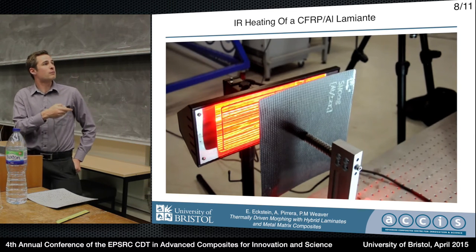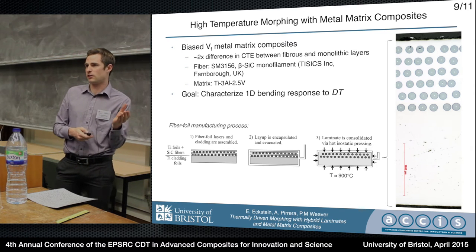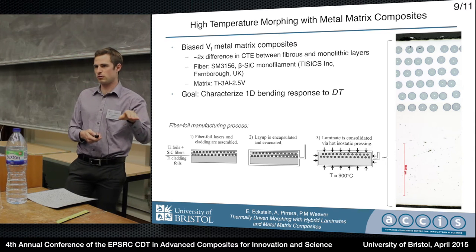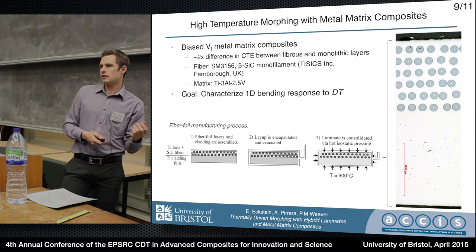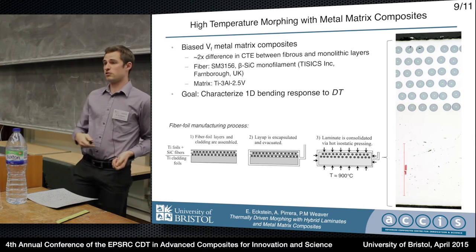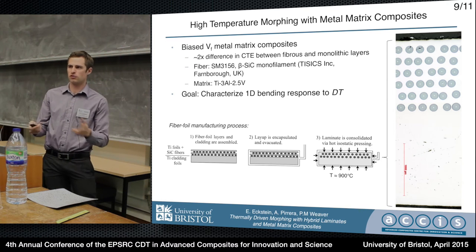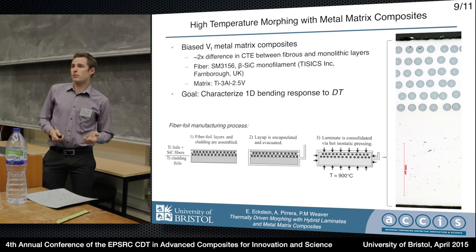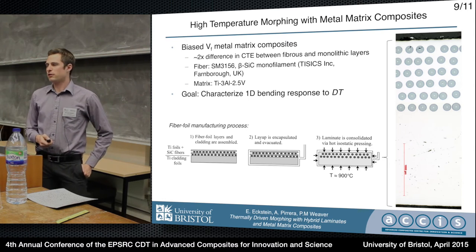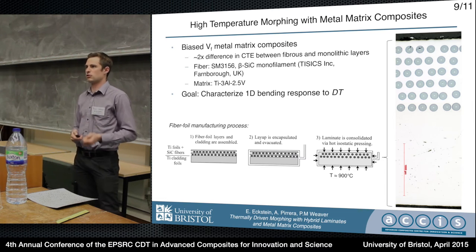This is a relatively thin plate, but you can make them quite thick. Stiffness scales with the cube of thickness, while displacement scales inversely proportional to thickness. So if you double the thickness, you get four times the point force at the end of the actuator despite having half the displacement — going thicker is generally better up to a point, as long as weight isn't a concern. That was carbon epoxy and aluminum, which is only good to about 180°C. The real meaty part of this problem is finding actuators that work at higher temperatures — 500°C and up — where normal actuators like hydraulics and servo-electronics dare not go. We're talking about the hotter parts of a gas turbine engine where engineers want variable geometry but can't yet achieve it.